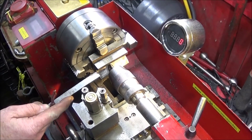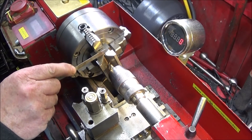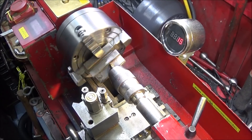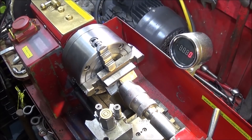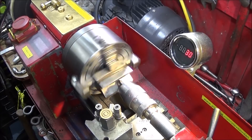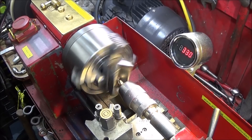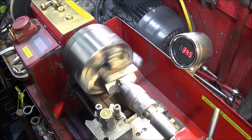You can sight down through the groove both ways to check that it's dead centre to the groove. Whenever I set up anything like this with an overhanging jaw, I always spin the chuck by hand first before I start the lathe up. Because it's off balance, you only use a very slow spindle speed.